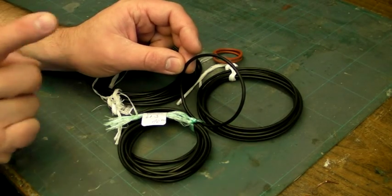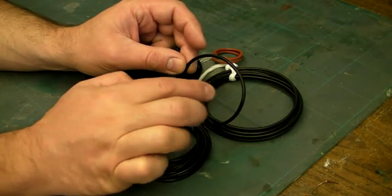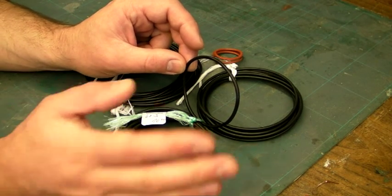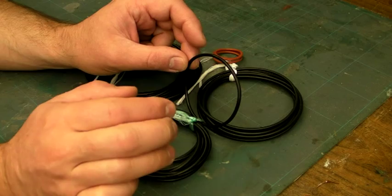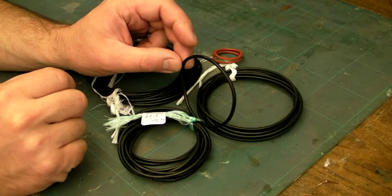When ordering, if I wanted a 3 inch outside diameter seal, I would order the 2¾ inch seal, assuming they're eighth-of-an-inch thick seals. You could also get 3/16 inch seals of 2¾ inch internal diameter — you can get them thicker or thinner depending on your requirements.